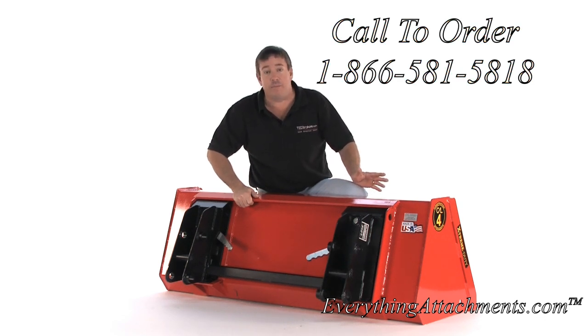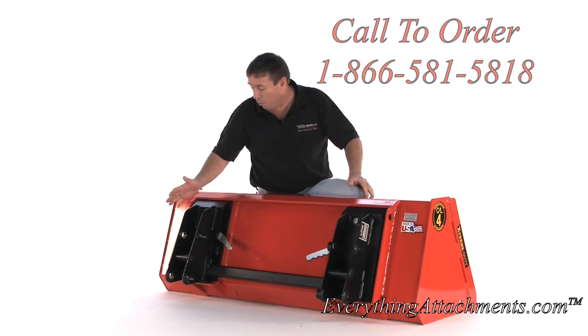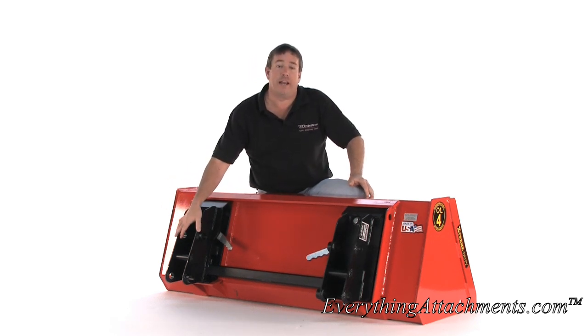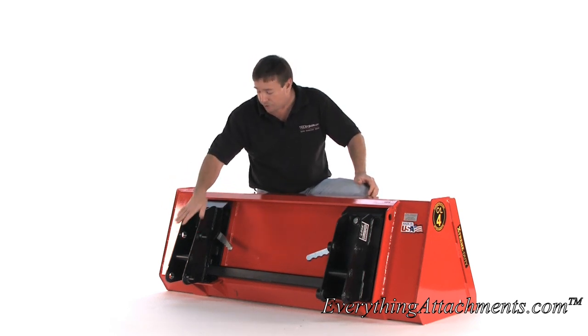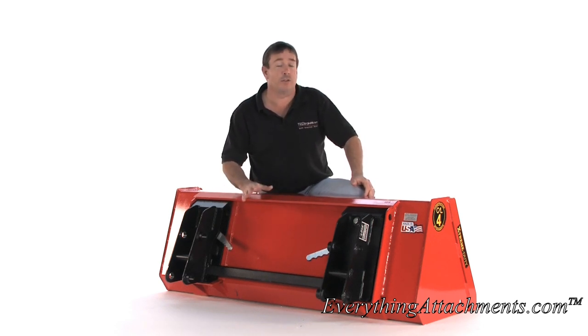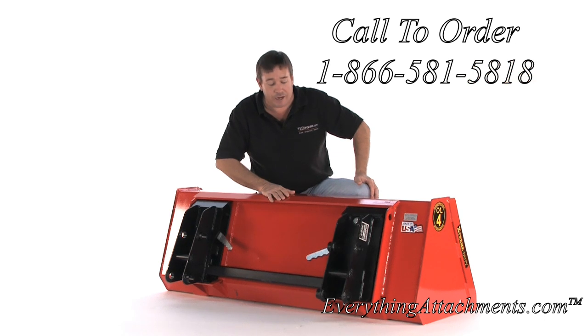You're certainly going to like changing them a lot better. This particular one is for a 16LA New Holland tractor, which is a TC 40 or 45. This customer did not get the Quick Attach that was available when he bought his tractor, so he's putting it on now. From here on out he'll be able to buy any attachment cheaper, get it quicker, and use a lot of different attachments because there are many companies that make attachments that don't offer the ability to make them for a four pin connection.